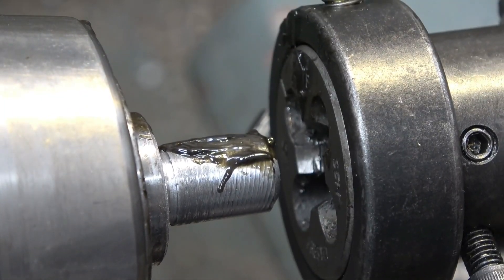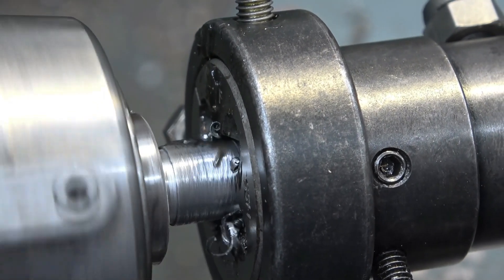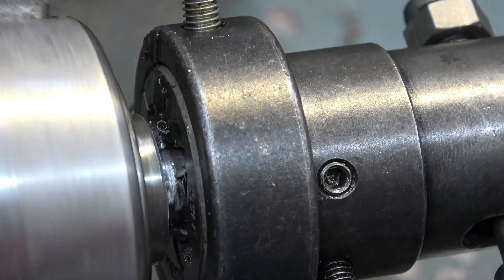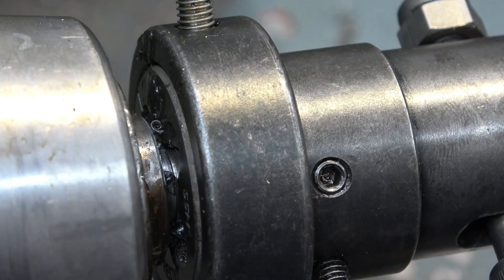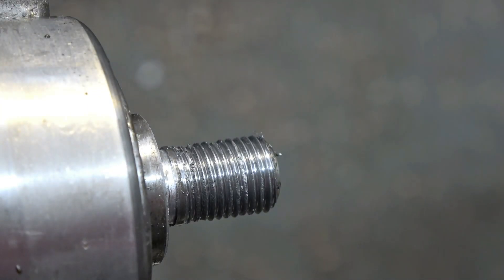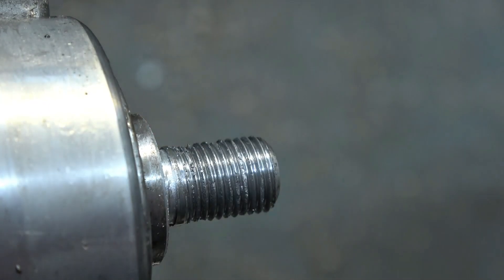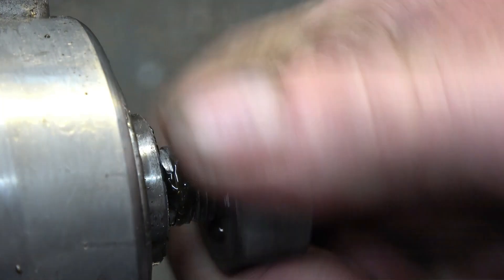Right, do the goal and see what happens — nice slow speed, and that's purely simply the friction on the Morse taper driving it, nothing else. I need to run a die nut up there now just to take that last little bit off. I'm lucky that I've got a lot of new old stock imperial taps and dies from a friend, which I use all the time especially on the steam engine stuff, so they've come in really handy.